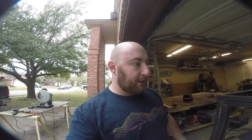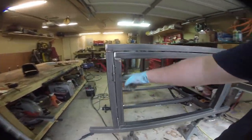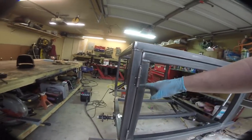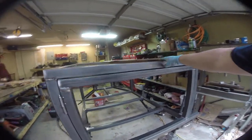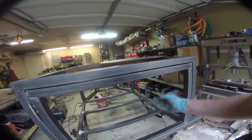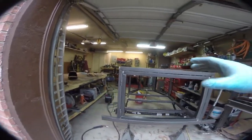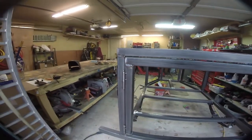Next thing on the agenda is our rear door. So let me show you what's going on here. We already got the door welded, got the hinges tacked into place. Still need to finish welding them. So like I said before, I tacked the barrel on both spots, make the door. I use a ruler or some sort of shim to shim it up, make the door square in the frame, and then tack on these guys. And don't forget your little grease bronze bushing.